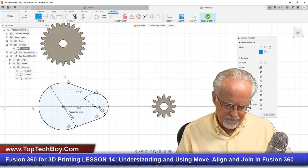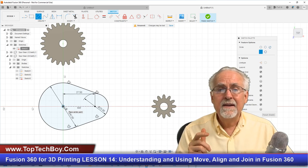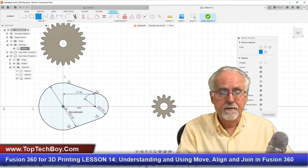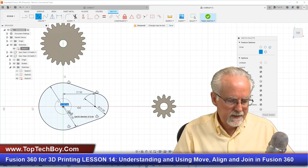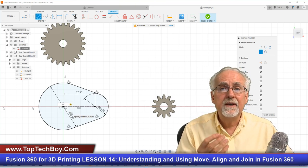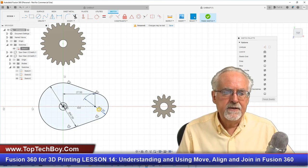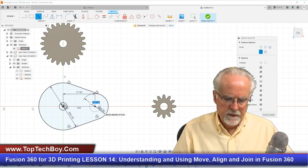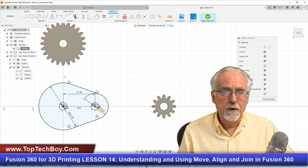And so if my hole was 7 millimeters thick, I need a tolerance. How big should my post be? Well, I am going to make my post here 6.8 millimeters, which will leave a tolerance of 0.2 millimeters. And then similarly, I will build a post here of 6.8 that will leave a tolerance of 0.2.